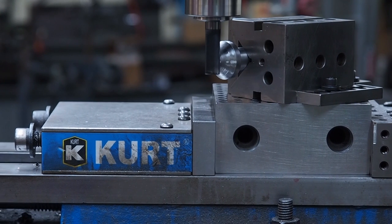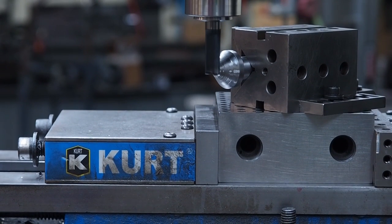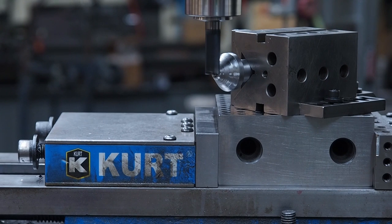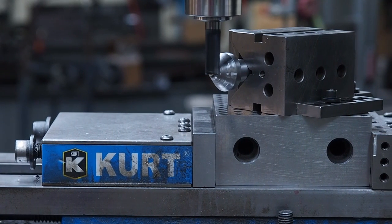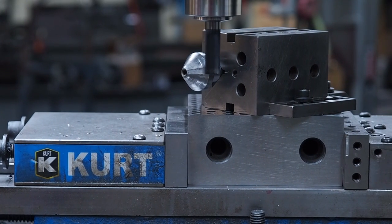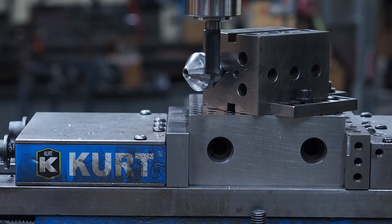And what I'll do is I'll come back up now. And lower them apart, so that I'm at the halfway. And like I say, I'll just go 615 right now. And when I'm going this way, I'm going to go ahead and I'll feel comfortable with 30 thousandths at a time. When I make it to that end, I'm going to only wind in 10 thousandths to come back the other way. But you want to snug the Y-axis down so that you don't get the backlash causing you troubles.